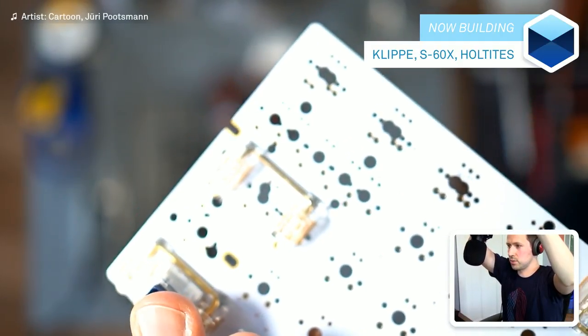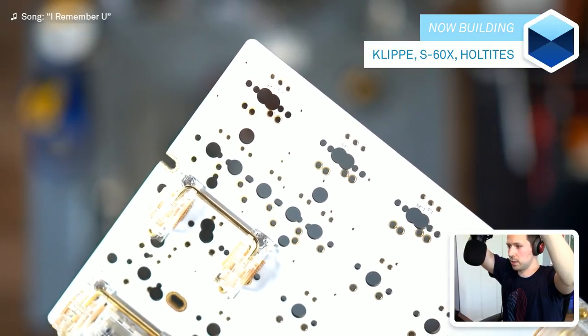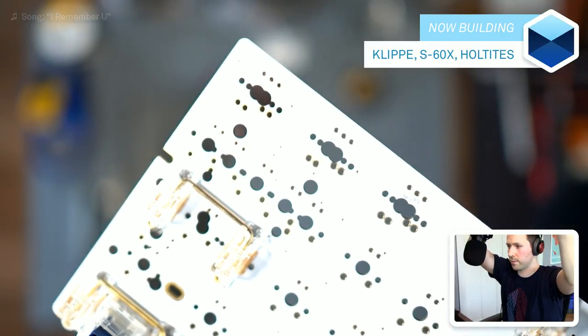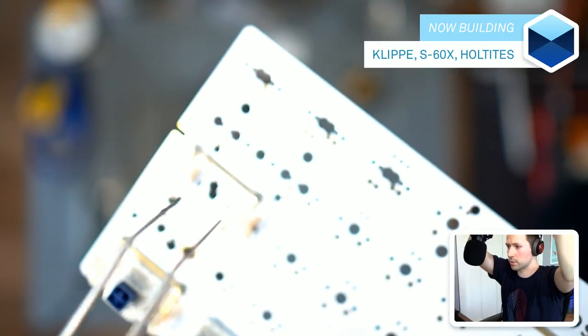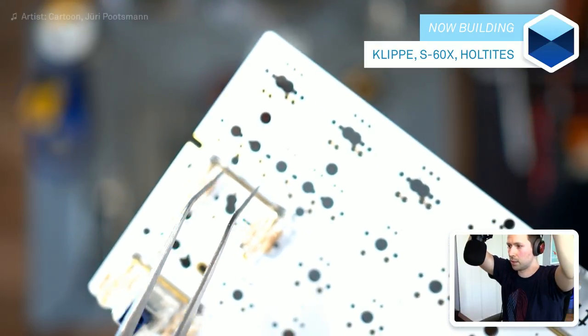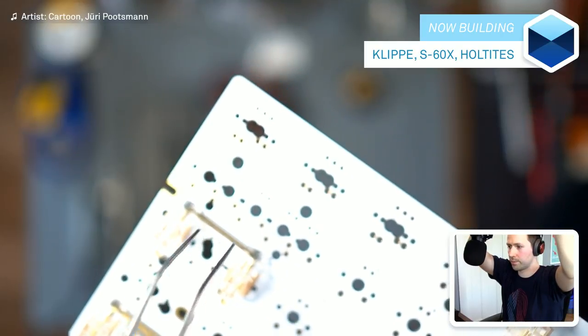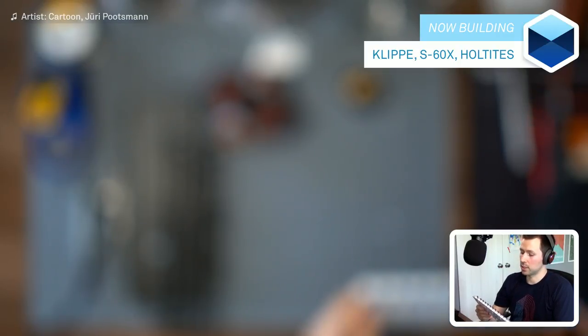Okay. This is a multi-use PCB. So you can see there's sort of a bit of a Swiss cheese issue here, right? The problem is if you look at this hole right here, if I can get it to focus. This is a bloody nightmare. All right, let me just explain it. There are a couple of pads that are open. They're not closed circles. One of them particularly is the backslash key. That backslash key, because of ISO support, the stabilizer hole splits that pad.